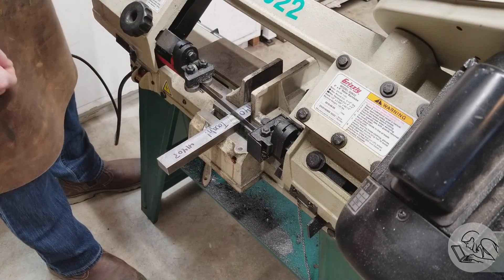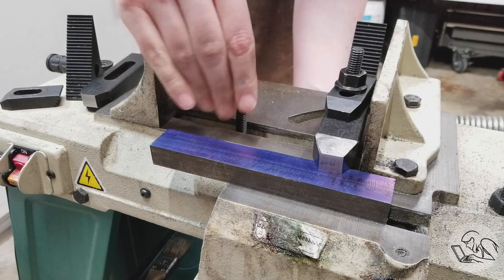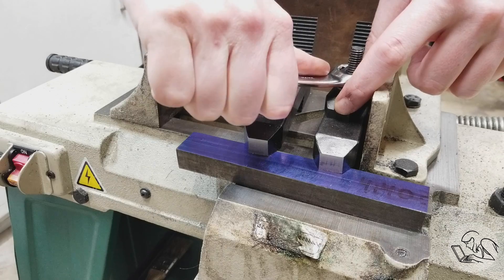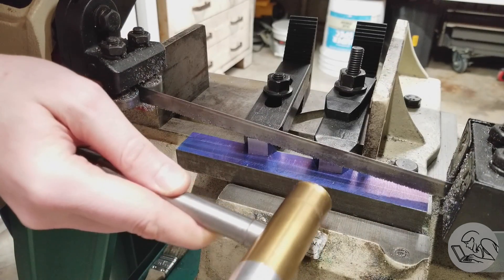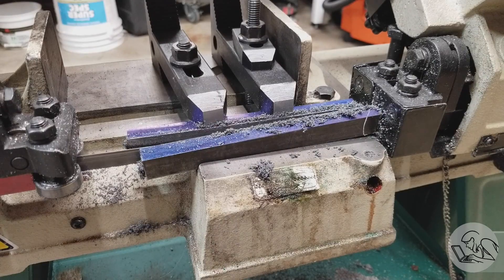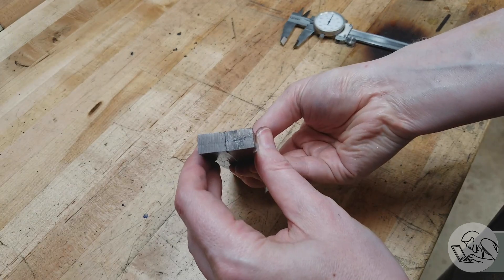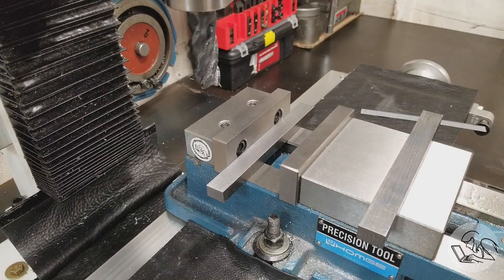I need to get four jaws out of this piece, so I'm going to chop a chunk off on the horizontal bandsaw, then split it down the middle to get my four jaws. I've scribed a line down the center and I'm clamping it in the T-slot to line it up on the saw blade. Near the end, the part sprung — some crazy internal forces got released when the cut was made. But the saw made a really great cut; I'm actually within a thou on the cut, which is entirely luck.